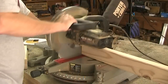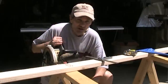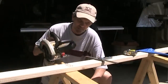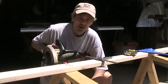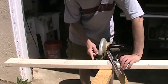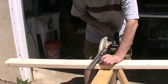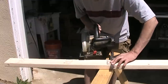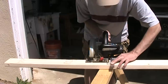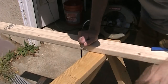I'm cutting four boards for the side pieces. Each of these is 13 inches. Now if you don't have a miter saw, you can easily make this entire project using just a circular saw. The only trick with using a circular saw is making sure that all of your cuts are square. Mark the length of your board — I'm going to cut this one to 24 inches so I put a mark here — and use a square to provide your straight edge. Put the square down, line your blade up with that mark you made, then slide your square over and make your cut. The only problem with that method is it's just a little awkward to do.